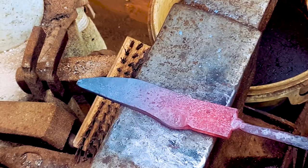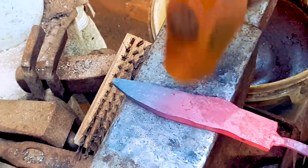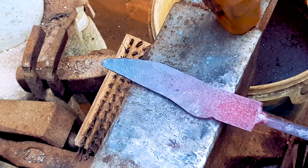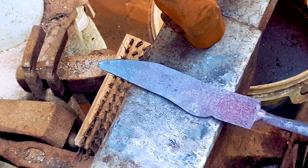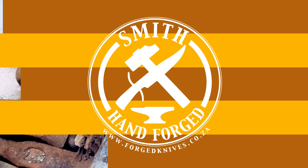You can take it one step further, which I'm going to do now. I've forged about three quarters of the way to the back of the knife. You'll notice that the edge is on the flat portion and not the rounded portion. Although it seems counter-intuitive, as we forge the bevel out, the edge is going to get longer and the blade is going to start sweeping up.